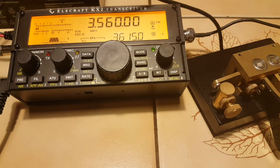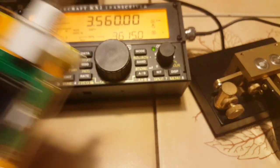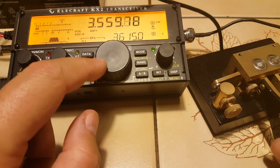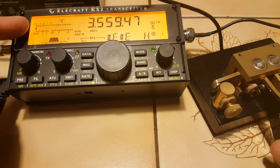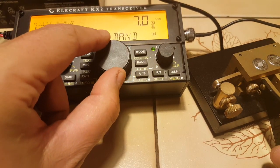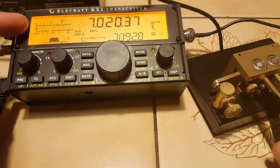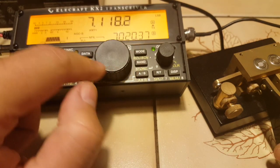The 8010P seems to work very well. I checked it with my KX2 because my MR100 analyzer is acting up and I think it needs to be recalibrated. Here I'm on the 80 meter band — let's go find a clear spot — and the SWR is about 1.2 to 1.3 to 1. Excellent on 80 meters.